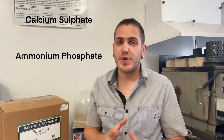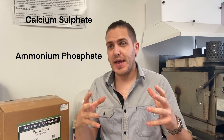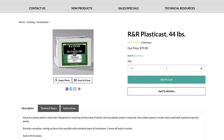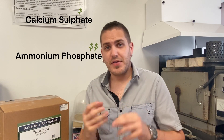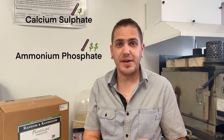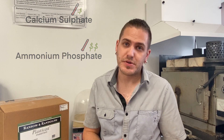The main difference between the two is that the phosphate bonded ones require a special additive and are much more expensive. The key difference is that phosphate bonded can handle the high temps like platinum and titanium, whereas gypsum bonded just can't handle that — it breaks down when you get closer to those temperatures.